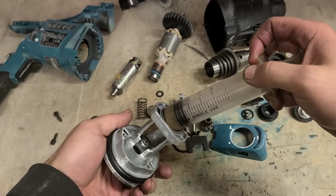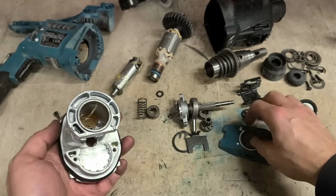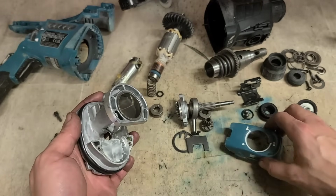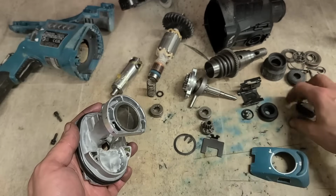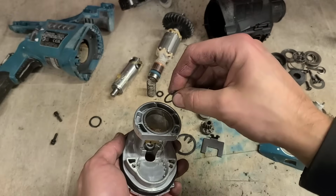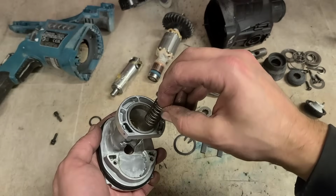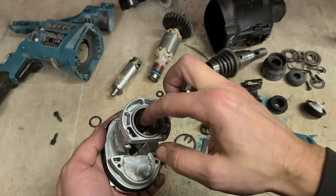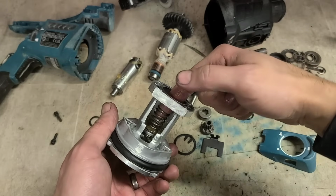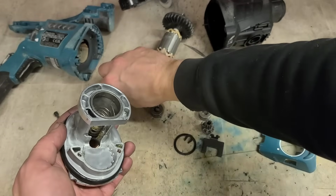Now don't forget down here, your pistons are going to be going down, and there's a spring in here, but you wouldn't want the spring pushing against the aluminium housing because it would wear out very fast. There's actually a metal washer at the bottom of there. Push that on first over the wee pointy boy in the bottom. And put the spring on top.